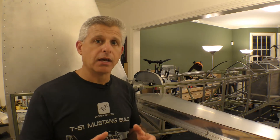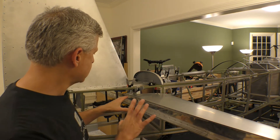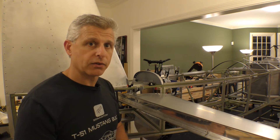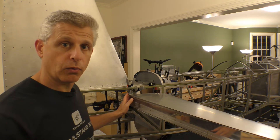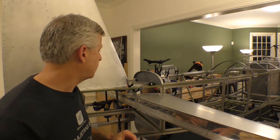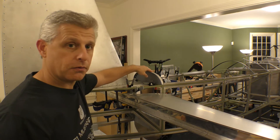It's really important that everything with our fuselage gets leveled, both fore and aft and laterally, so that we can make sure that everything is square. We've done that, the levels are in place, everything's set, and all I did off camera was clamp this forward portion of these horizontal stabilizer pieces in place so that we can get the positioning correct in exactly how it fits in this forward carry-through spar. With this in place and with the vertical stabilizer on, we can now also attach the vertical stabilizer to the frame and this first Station 12 upper bulkhead.